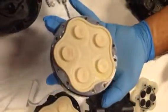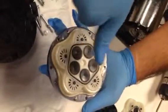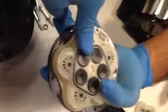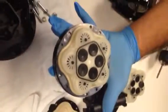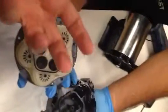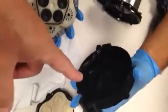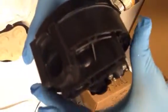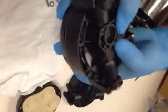We first take the lower housing assembly in this position. We place the valve housing assembly on top of it, gently press it in, making sure that all of the edges of the valve housing are inside the diaphragm rim. Holding the pump in this position instead of turning it over, in which case the outlet valves may fall out of place, we put the upper housing assembly over these two pieces, making sure that the diaphragm is not pinched. Just a gentle feel for how the part will come together.